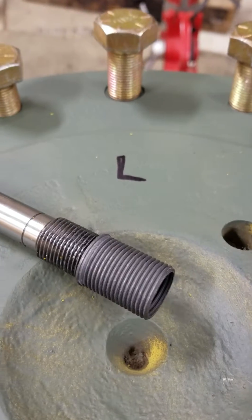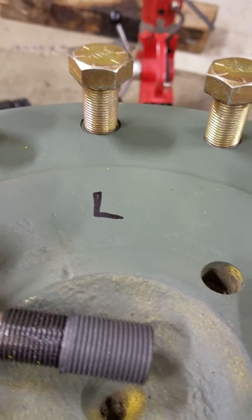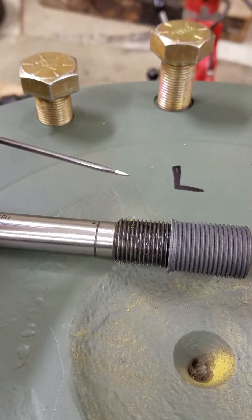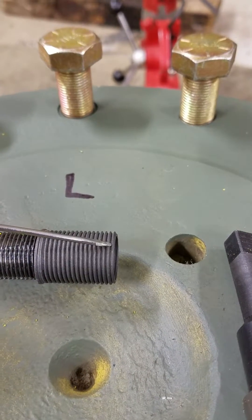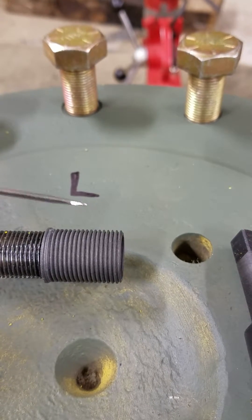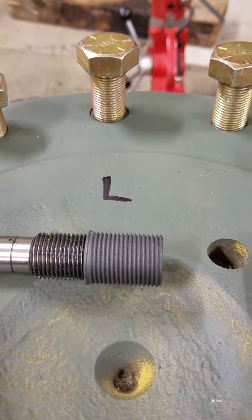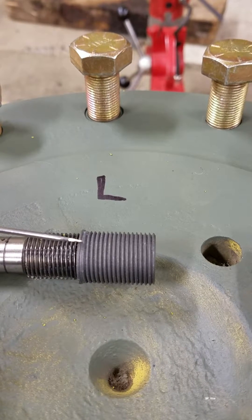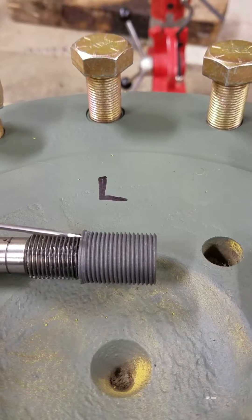The problem I had was the length of the insert — I believe it's about 1.1 inches — and they give you an insert driver tool for putting it in. What I ran into was that the driver tool, when it gets down to the very end, forms the last three or four threads into the bore cut by their tap. The insert would hang up a little bit on the way down, and then the driver tool would start expanding the threads long before the insert was seated — jamming up partway down.